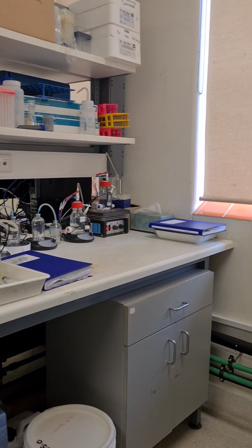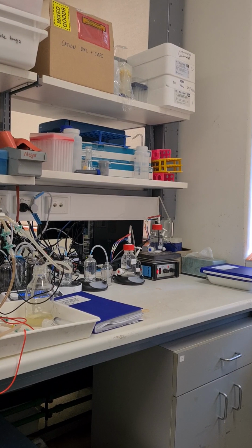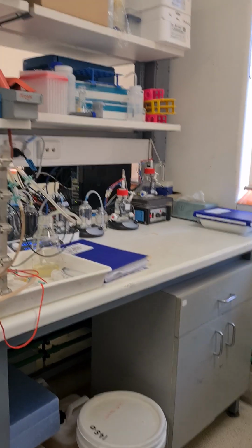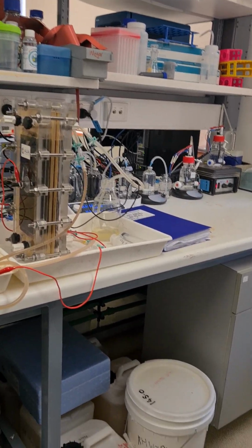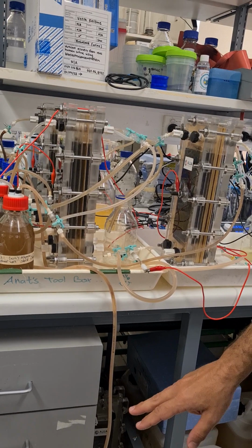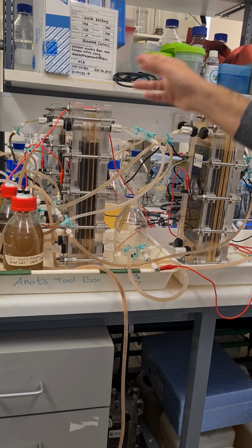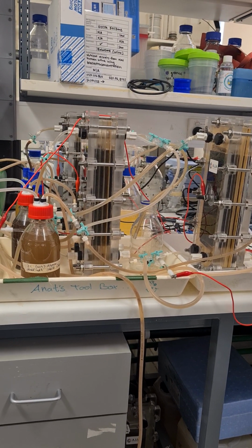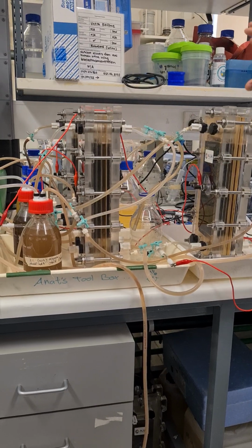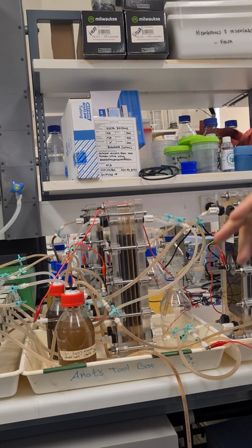So what's your best scenario? Let's say you want to install this in a Brisbane public toilet. Well, hydrolyzed urine goes to your technology, and depending on how much you want to concentrate, you directly apply it in the parklands as a diluted fertilizer. When this works well, the urine is hydrolyzed in a tank, so you don't have any calcium and magnesium. It comes into this fed continuously, and at optimal conditions we'll get enough concentration that the fertilizer product is clear, so no growth, and strongly ammoniacal, so full ammonia. And that product is mixed with water for fertigation of the local flowers and horticulture.